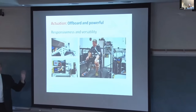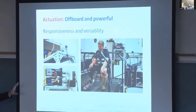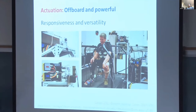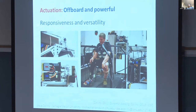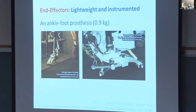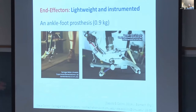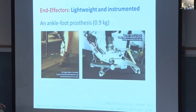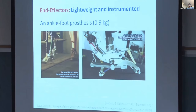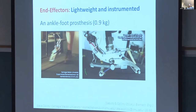High quality torque control is therefore very important. And over the years, we've developed an approach that we like. We control motor velocity as a function of three terms. First, there's a proportional term on the torque error, which gives us reactivity on a millisecond-by-millisecond basis. Then we have a damping term based on the motor speed for stability. And finally, there's an iterative learning term, which provides model-free feed-forward compensation. This is especially good in a complex system that's hard to model, like our emulator and the human attached to it, that has a cyclic behavior like walking.